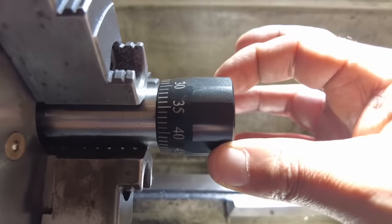A tuner doesn't tune the ammunition — it tunes the barrel. How it works is: once you find a tune setting, that barrel will tame down harmonics and will shoot the majority of 22 long rifle pretty accurately. Leaving it at setting 15, I could just test some other lots of ammo. Unfortunately I didn't bring them out today — I wanted to compare to the rifle's original results when I shipped it to the client. What I was seeing before were consistent five-shot groups, and that's my standard when I build these rifles. I like to brag that my 22 long rifle builds don't need a tuner — I ensure they'll hold a 0.3-inch consistent five-shot group at 50 yards and sub one inch at 100 yards.